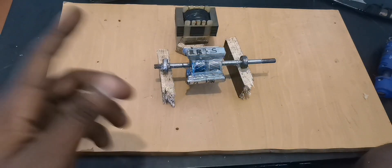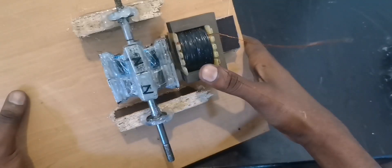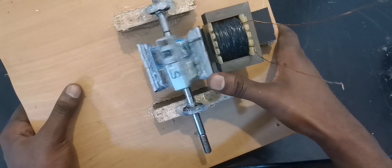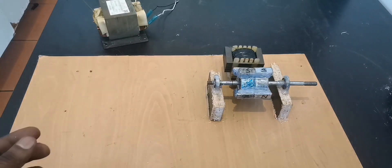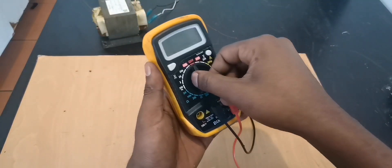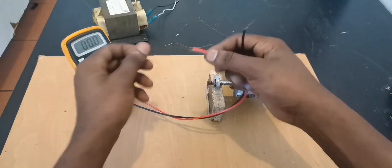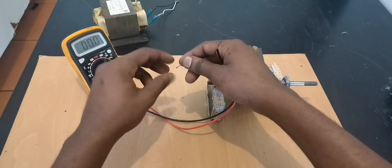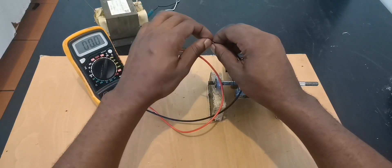I'm going to pause the video to set up everything. Alright, our low-voltage generator is ready. You can see there's a big gap but I believe it's going to work. Let me check — nothing under here, nothing. Now, before we bring back our step-up transformer, I'm going to test it. Setting the multimeter to 200 volts — these wires will be our low-voltage AC output.